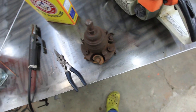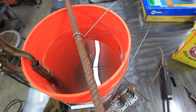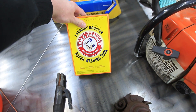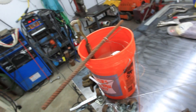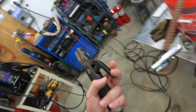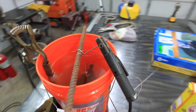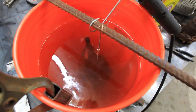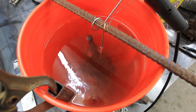These are the tongue and groove heads. I've got them suspended in a solution of washing soda and water — Arm & Hammer washing soda. You're supposed to use a battery charger set at about 10 amps. Well, I don't have a battery charger handy, but I do have an XMT304. So we're going to clip that on there. I just have a piece of stainless wire, eighth inch filler metal, holding that guy.